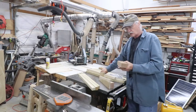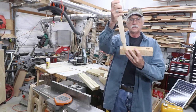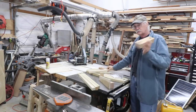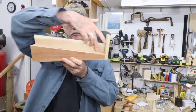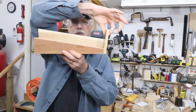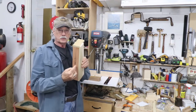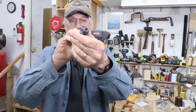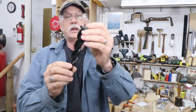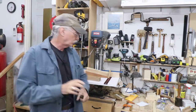This is one of the blocks and these have to sit at a ten-degree angle, so the hole has to be drilled at ten degrees. Here at the drill press I made a jig — a ten-degree slope jig with a backing plate for clamping the workpiece and a stop to control depth. I had to remove the table and fasten the jig directly to the drill press table because of the depth of the bit. This is a one-inch three-flute spiral cutting drill bit with a spiral tip that wants to draw itself into the workpiece, and I didn't want that.